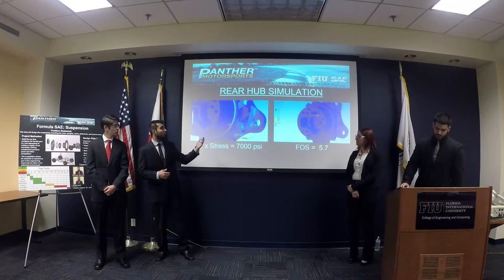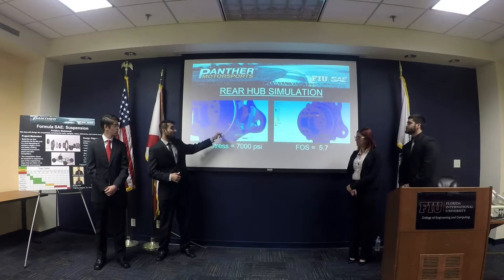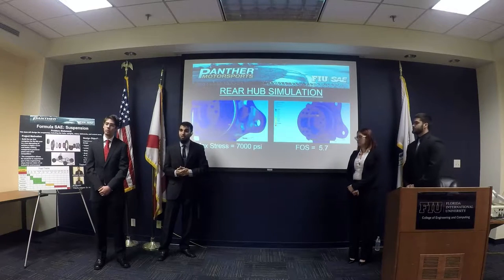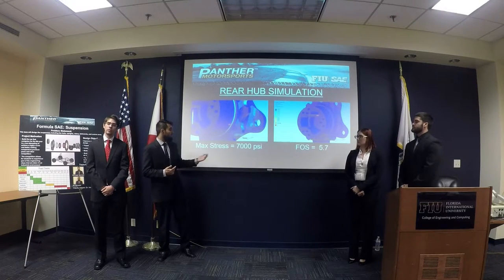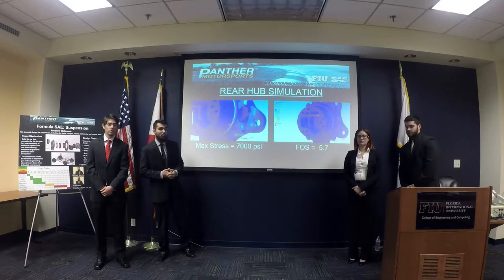Finally, we have our rear hub simulation. We can see that the maximum stress is occurring on the same edge as it was for the front hub, and it's causing a maximum stress of 7,000 psi with a factor of safety of 5.7.